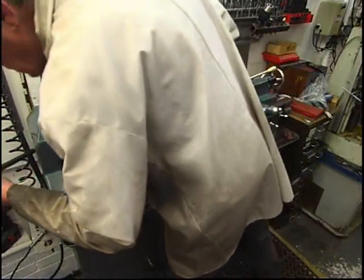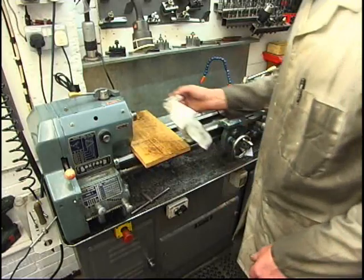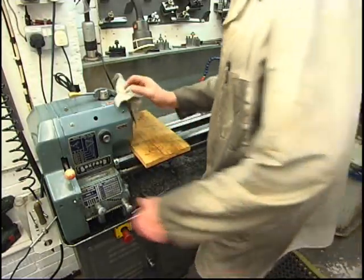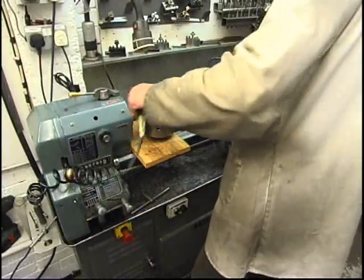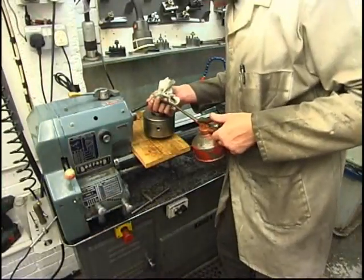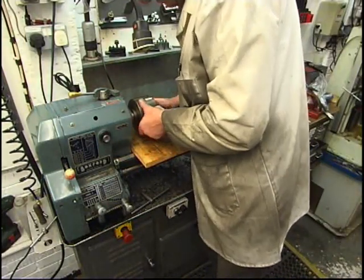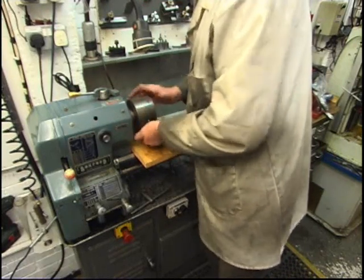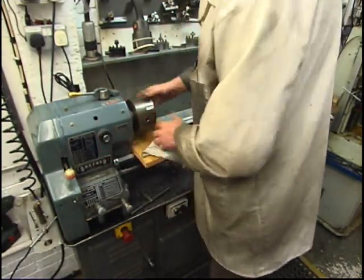Take my centre out and put it back where it lives so it won't get damaged. Chuck back on - make sure the register's nice and clean, make sure the hole in the chuck's clean. The front face there is always handy. Drop of oil on the end, hinge it out - it won't do any harm. That's all it takes.